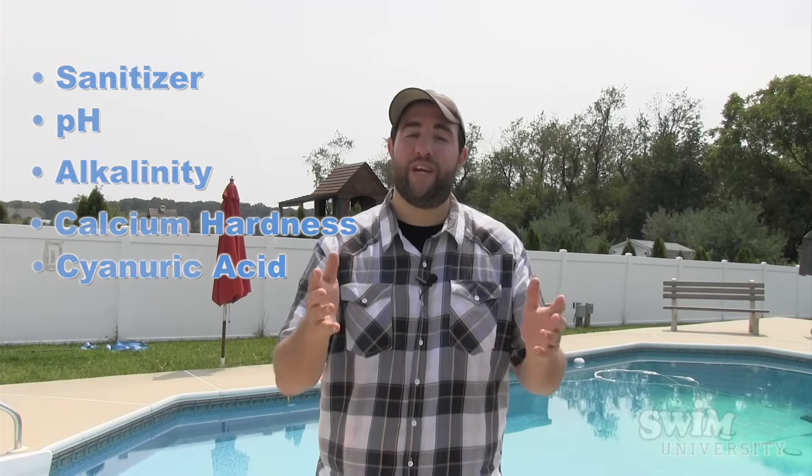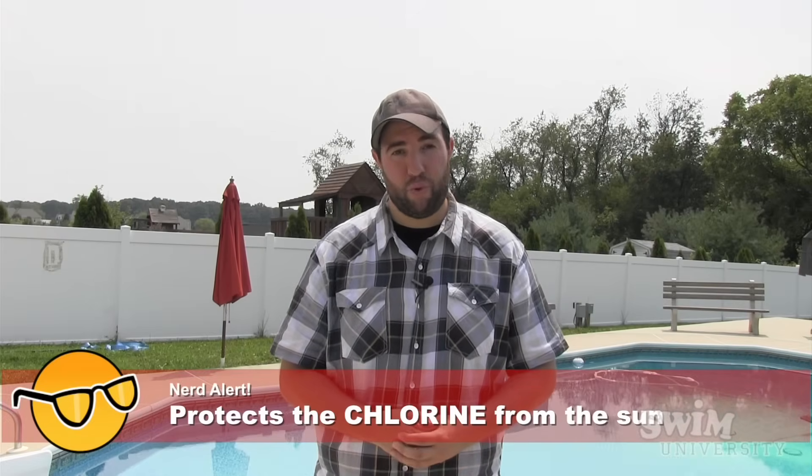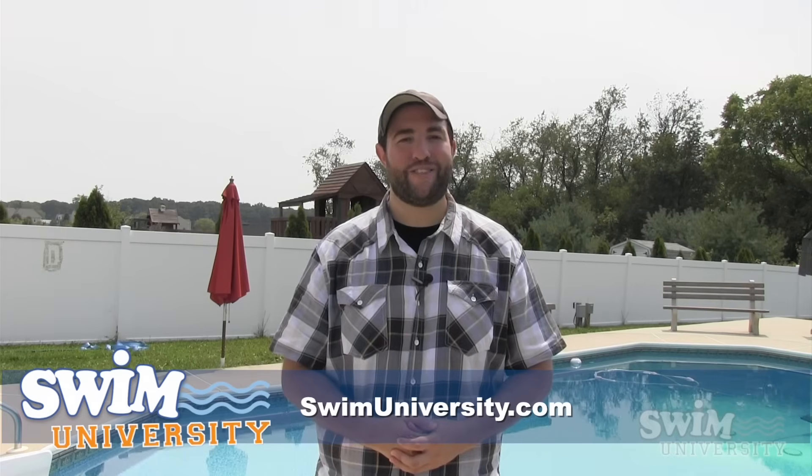So that's it. You can test the pool yourself using a test kit or some test strips, or you can take a sample of your water to your local pool dealer and get it fully checked for everything. You want to make sure that you check specifically for chlorine or the type of sanitizer you use, pH, alkalinity, calcium hardness, and cyanuric acid — or what they call chlorine stabilizer — which protects the chlorine in your pool from sun damage. And you can visit our website, swimuniversity.com. Thanks for watching.